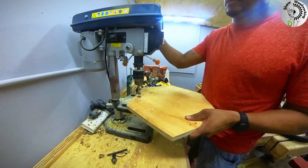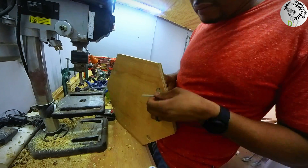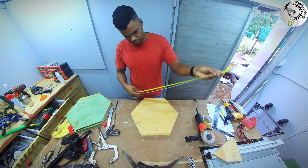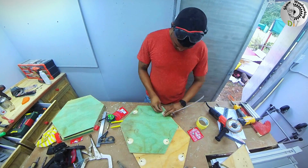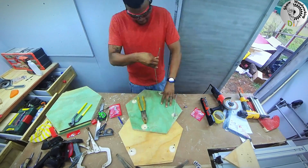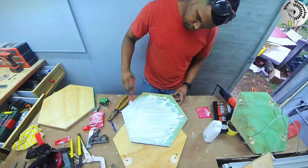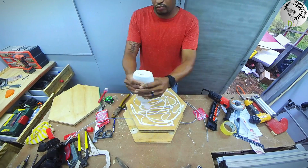This next step is very necessary only on the top hexagon: we need a 3 mm indent on the side where the cable will be turning, because we need to glue it flush to the other two hexagons. Before we get to gluing up the seat, we need to install the top cable first — cutting the cable to 60 cm for all four pieces. The cable end would be about 7 cm long; I use a pair of pliers to bend them, then install the cable clamps. Only now can we glue up our seat, applying glue generously and using brad nails to make sure it doesn't move around when we clamp it.